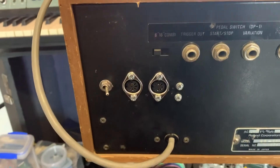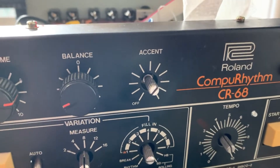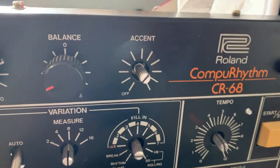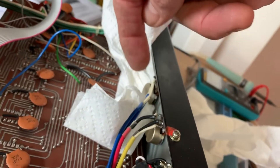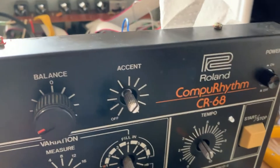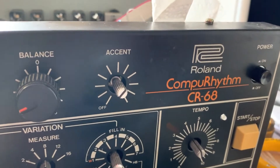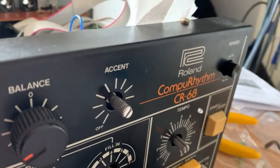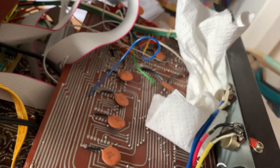When drilling the holes for the back panel, I use my favourite Bestest Buddy step drill — these are brilliant. The accent knob was scratchy, so you really need to spray these out twice. What I do is put some paper towel to soak up all the nasties, spray it like mad all the way inside and through the front of the pot as well, leave it for a while, then give it another spray and turn it to clean it out. You really need to do it a few times. The first time just softens up the junk and contaminants, and the second spray actually washes it out. If you just do it once, it'll go scratchy again as soon as it dries out.